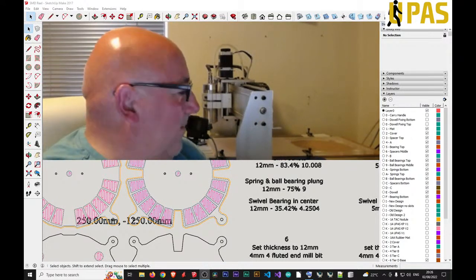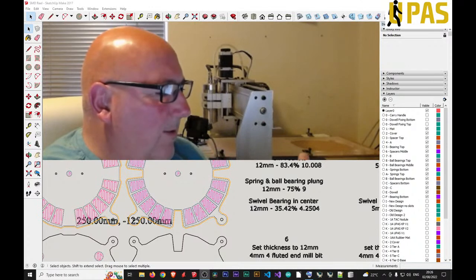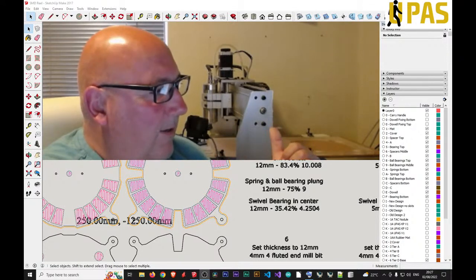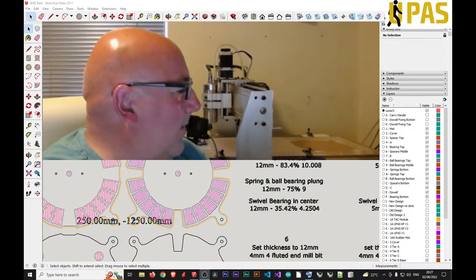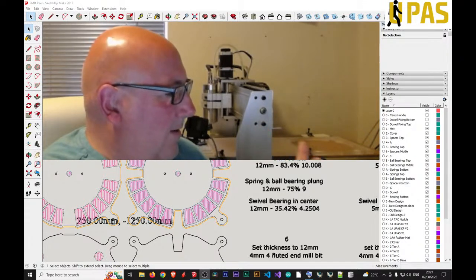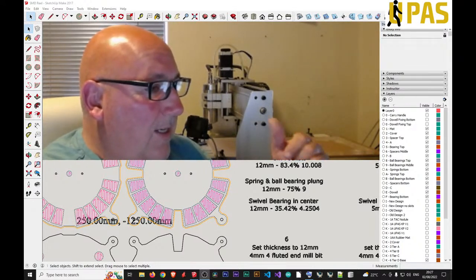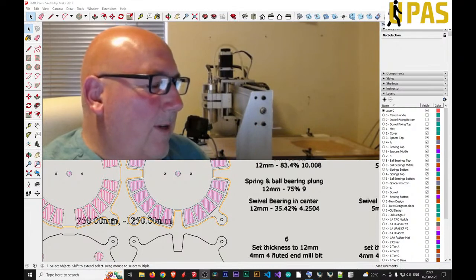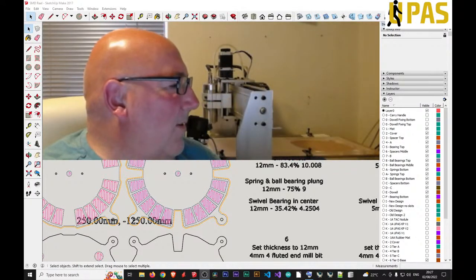I must invest in a piece of billet aluminium the size of the bed at some point, though it'll take ages to mill it flat — milling aluminium flat takes a long time and it's very noisy, squealing. Anyway, I've got it as flat as I'm going to get it now. The problem is when you clamp it down — you can see the clamps there — if you clamp too hard it bends the material, just warps it. You really need a vacuum table.